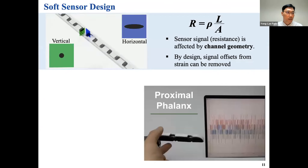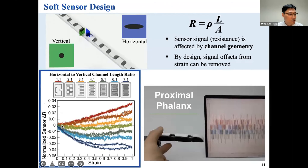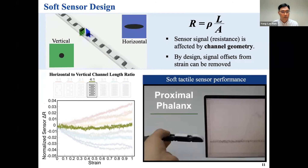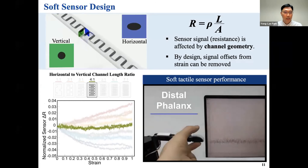So we decided to use soft sensors using liquid metal embedded micro-channels. The resistance of the micro-channel is determined by length and cross-sectional area. Depending on where you place the micro-channels, you get different cross-sectional changes when you stretch. Using these cross-sectional changes, we can design patterns where even when you stretch the soft sensor, the resistance does not change much. We decided to use this type of pattern so that even with an elongated finger, you don't get a different initial resistance. You can place soft sensors anywhere on the finger and get tactile information even while stretching or contracting.